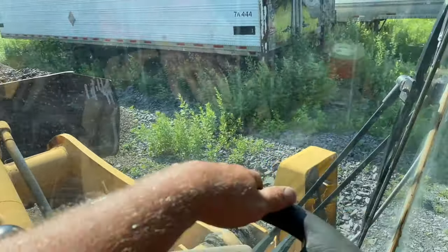Here comes our mud, second truck. He's a little bit late. We gotta get it in because we got a little square missing in our garage. So we're going to bring him in and whatever slump he's got right now, we're gonna fill that hole in. And then we'll probably add a little water to get him back to about a 6 slump. And then we will blow it in the back like we did the first truck.